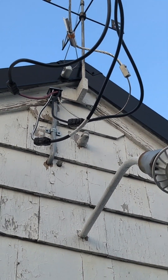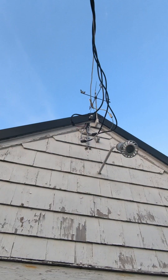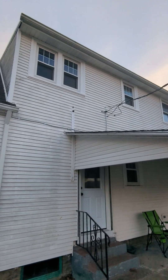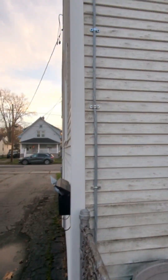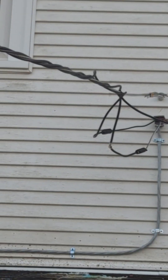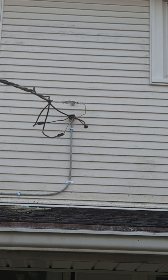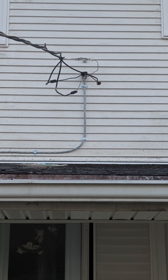My ground is going to the bare aluminum on the quadplex. I'm going all the way across, three feet from both of those windows, and I'm a little over 12 feet up on the side of the house from the ground. Here's my SER coming out with clamps every two feet, and here's my weather head. I need to adjust these drip loops — they're looking a bit wonky — so I'll get up on the ladder and fix that, tighten things up.